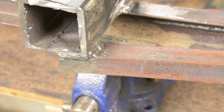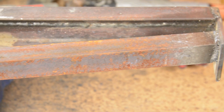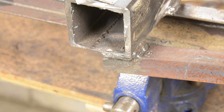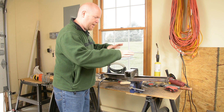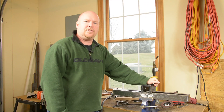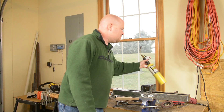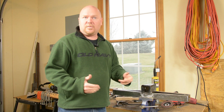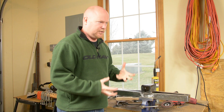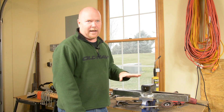Finished product. We've got a diagonal piece that runs the length of this thing, all tied in there. It's been wire brushed — no grinding. I'm going to try to grind as little as possible on this thing because there's no point in grinding away weld that may or may not be contributing to strength. Got another one of these to do and then this bottom unit is going to be complete. The 90 amp wire welder from Harbor Freight is holding up fantastically — a little help here and there never hurts. I don't consider it cheating. This is not going anywhere.